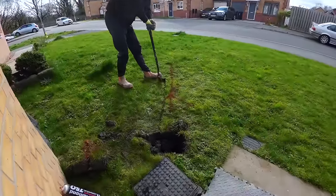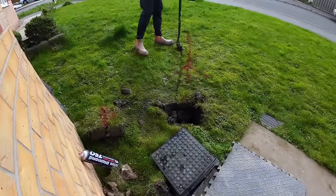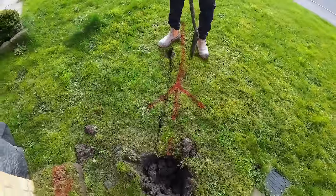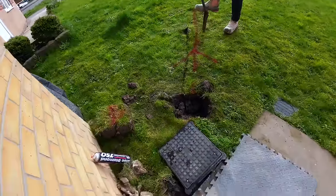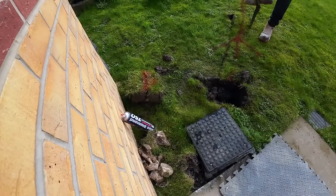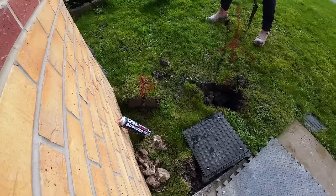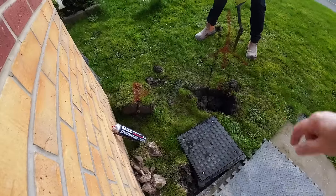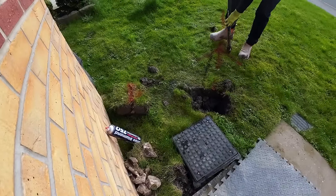So what we're doing is we've got to move this to where Alex is. That corner there, that's the corner of the dig. So we've got to go past the dig. So it comes straight out here. We need to put a bend on it, extend it, and drop the chamber up there. So it's still shallow enough to be able to rod it up there. This is the only thing we can do with it.